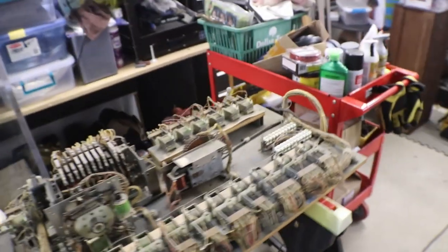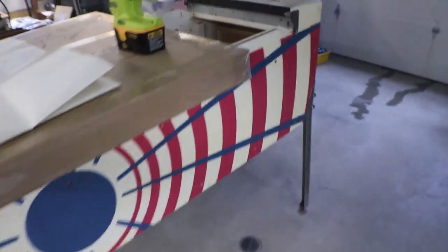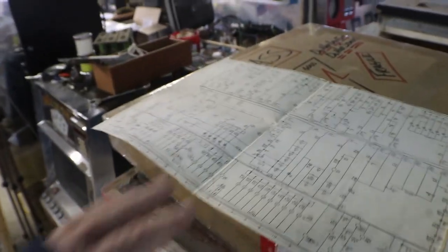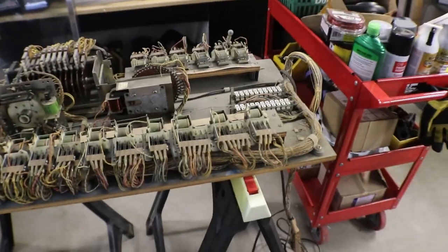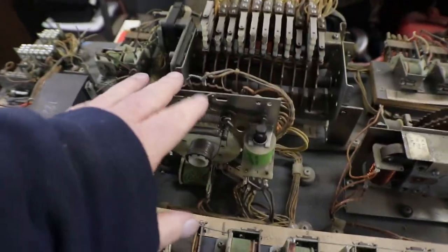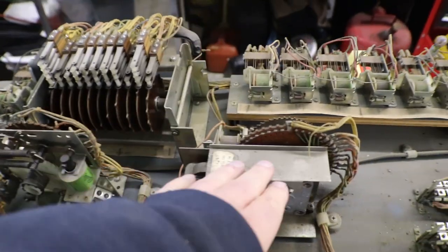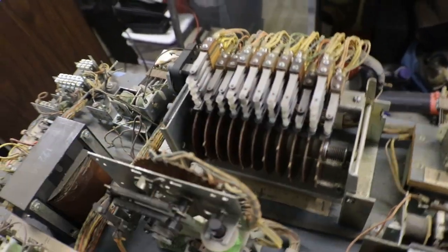The second episode was me cleaning the cabinet and putting a new bottom on the cabinet, which is right here. Right now it's kind of going to serve as a work table for my schematics, because I know we're going to be needing them once I get into this. But first, we're going to get all these switches cleaned up, all the contacts cleaned up, the ball counting unit and the flash motor unit, and we'll get all the contacts cleaned on the score motor unit.